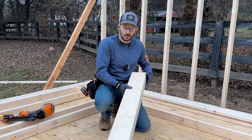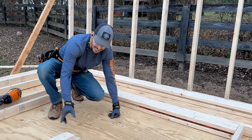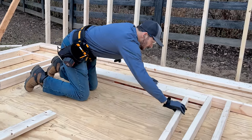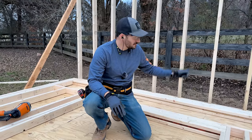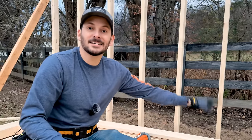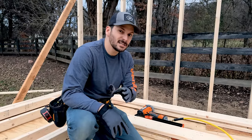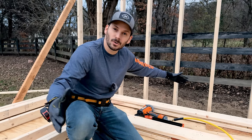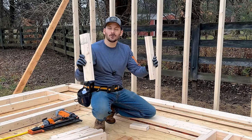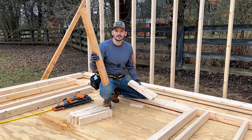I made up a header for the doorway and it fits right in between — nice! Then the little jack studs go in place to hold it up. I'll nail everything off and then just handle the windows. I've got everything framed out except for the windows. I decided not to put a double top plate on this section since it's not carrying much load — I'll add a top plate across the whole thing during assembly for structural integrity. I also cut a spacer so all three windows will be the same size, making installation go smoothly.